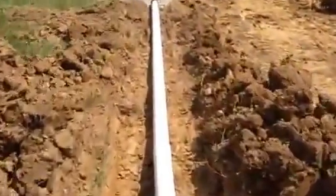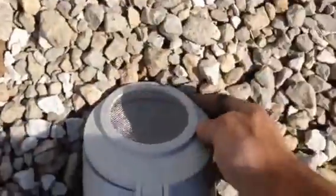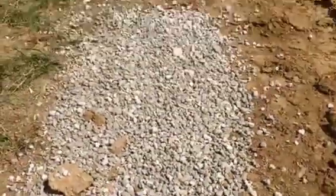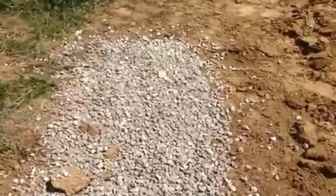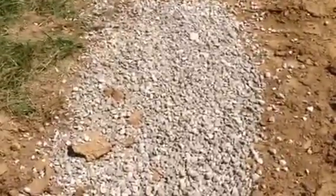At the very end, we have a rodent screen and a mosquito screen to prevent any rodent from burrowing into the pipe and going back down into the cistern. What we usually like to do is put some gravel at the end where the pipe daylights, just to notify people that there's something here that you may want to watch for.